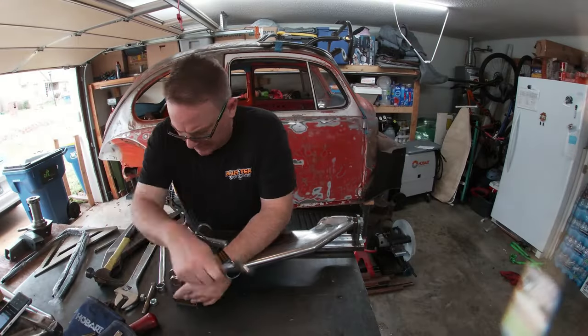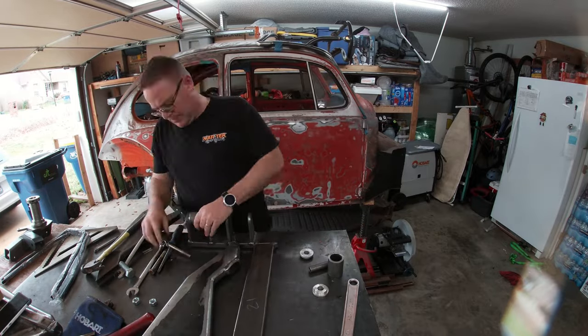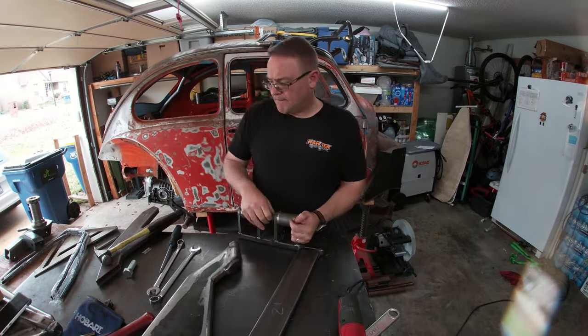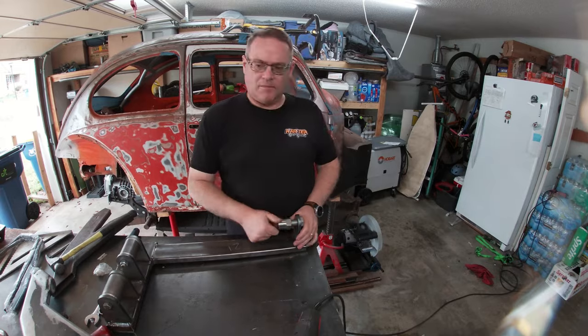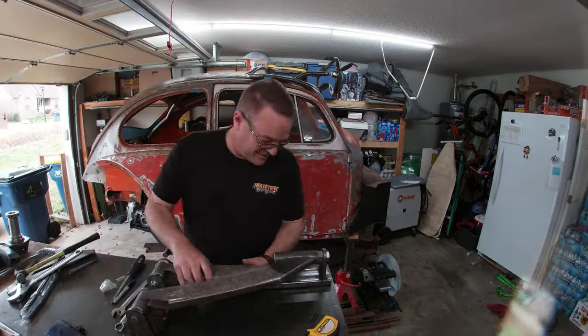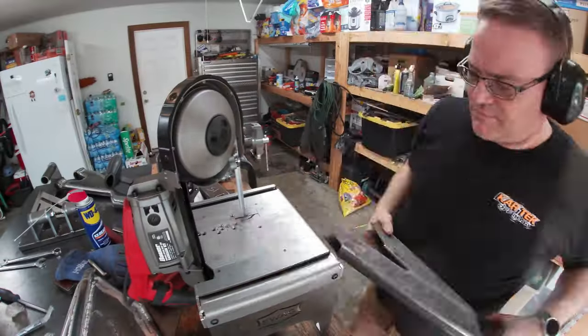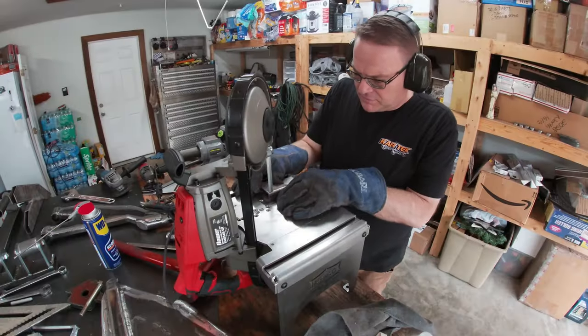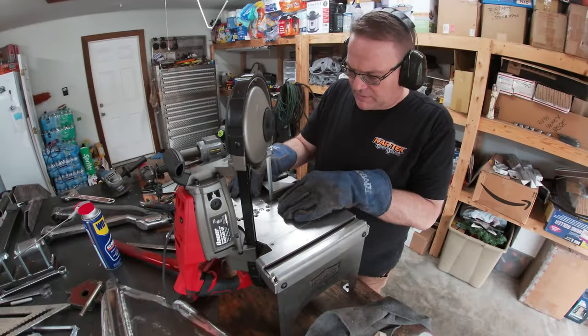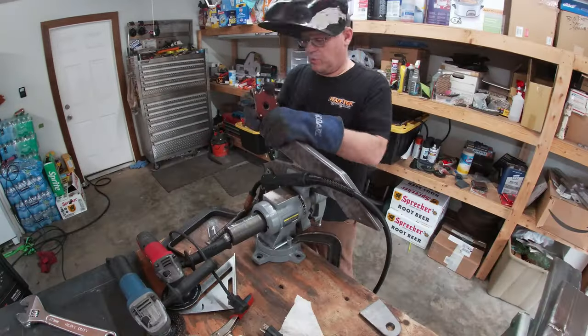After removing the prototype arms from the jigs, I bolted all the new pieces in for the new arms. With everything bolted in, I then held the substructure in place, making sure it lined up just like the prototype. That being the case, I trimmed everything to match and started coping the substructure. Once I was relatively sure everything matched up, I finished out the substructure by closing up all the openings that I had left open.